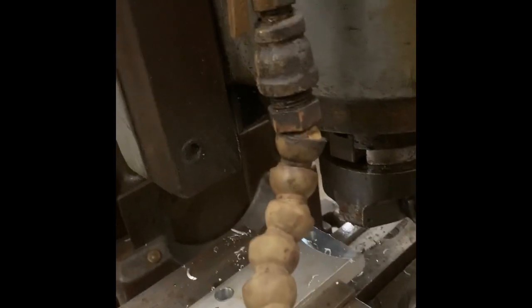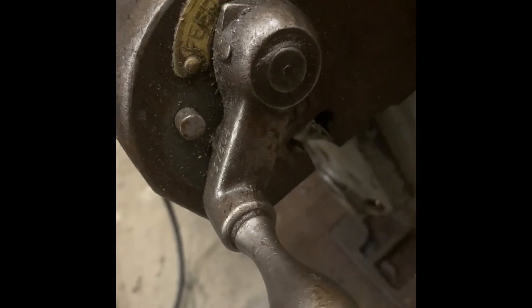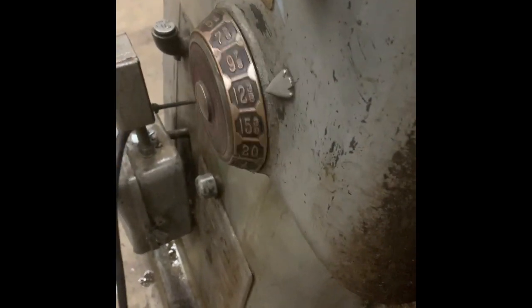We're going to turn the spindle off, which is required to set things. We'll go ahead and use this feed select lever right here, and that will turn our dial selector on the side of the mill. You see the feed rate dial is just moving here. We're going to stop on 1 and 3/4 inches per minute. So we're going to set 1 and 3/4 inches per minute. And we did that by this lever. Now we're going to re-engage the spindle with this big lever here.